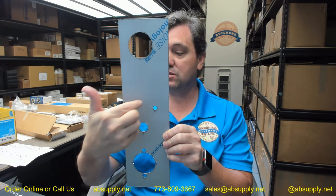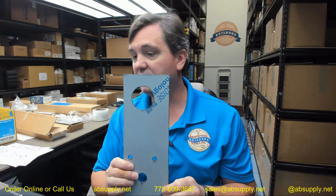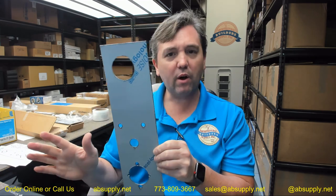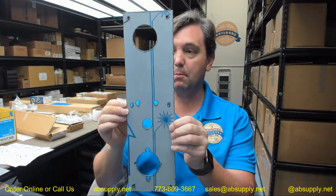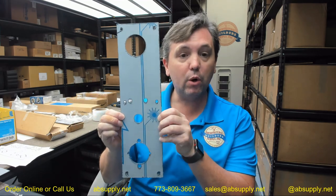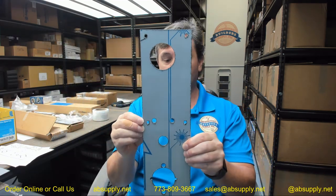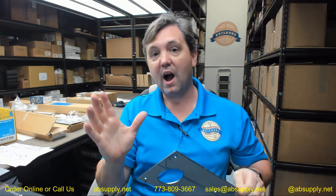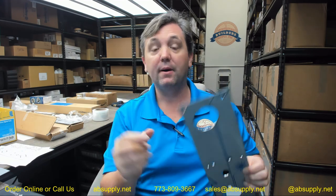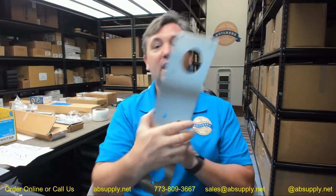The centers of the mounting holes are too large and they are in the wrong place. According to the sketch provided to the manufacturer, they did not have the mounting holes — which I could argue are not necessary, but the client wanted them. The corrected plate is here. You will notice that the center line is not in the center because the client needed to shift the plate installation away from the projection of the stop. As a result, we manufactured one left-hand and one right-hand plate, where the offset of the center line is one left and one right, so one can go on the exterior and the other on the interior.